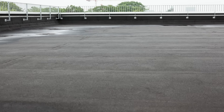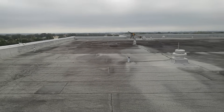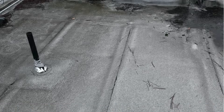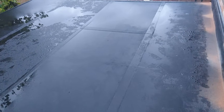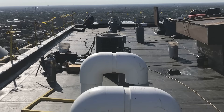Flat roofs or low-sloped roof assemblies can be one of the most challenging building conditions to work with, as the extremely shallow roof pitch means water stays on the roof longer compared to a steeply sloped roof. We also use a completely different range of materials, which can generate confusion and misapplication of materials and systems. Condensation is another common problem, but flat roofs are not going anywhere, especially in commercial buildings. We need to start getting these roof assemblies right, and it all begins with how the roof is designed.